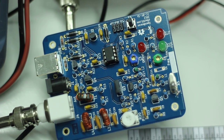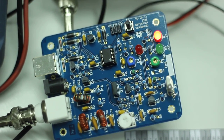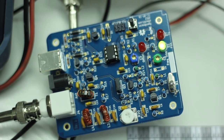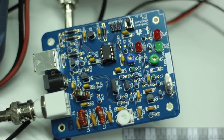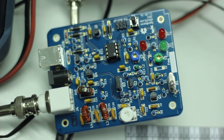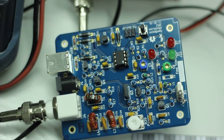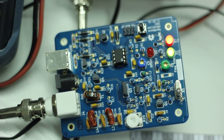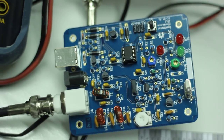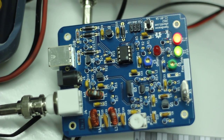What we have here is the Open Beacon Kit, which is a slow speed Morse code, Hellschreiber, and dual frequency Morse code beacon. All this thing does is transmit a preset message — generally it'll transmit your call sign. There are two LEDs: the red one indicates that the transmitter is active, and the green one gives an FSK status. We have it set to Hellschreiber mode right now.